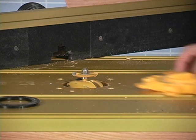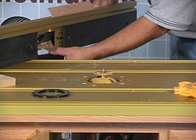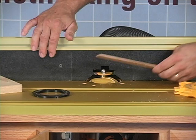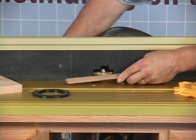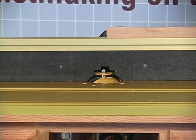I'm going to make that panel cut in two passes. We're going to simply swing the fence out, remove that insert from our fence. Table and fence come with three of those inserts. Drop it right into the pivot, straight edge onto the bearing, and line that up. Now we're taking out way too much material to take this in one pass, so I'm going to scoop my fence over and only take half the material out on that panel cut this first pass. With this being a larger diameter bit, we need to turn the speed of that router down to around